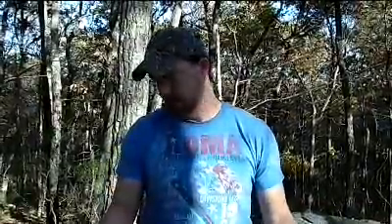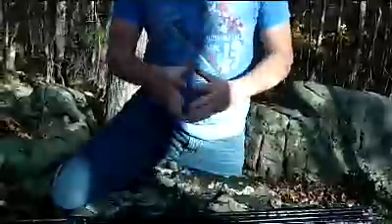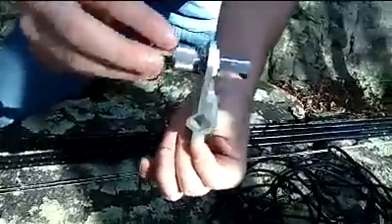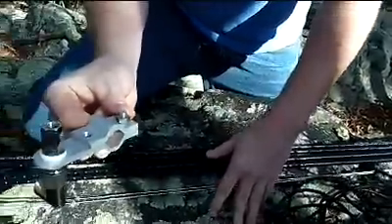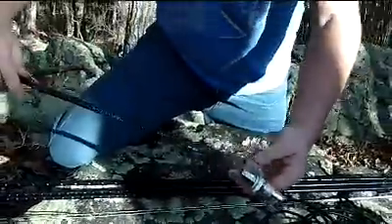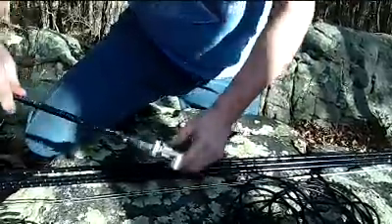I have hamstick whips for both 20 meters and 40 meters here, and I'm going to configure it into a vertical dipole. The reason why I like a vertical dipole is that I get a great DX angle — a low angle of radiation out from the hamsticks. It works just like a vertical antenna, but you don't need all the ground radials. Here I have a tee that I made — it's kind of just a trucker's mirror mount for a CB whip. They would normally mount it to their mirror with their CB whip going up, and what I did is I drilled and tapped for a second one. One goes in here just like a CB whip would, and then the opposing side goes into my other drilled and tapped hole.